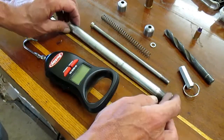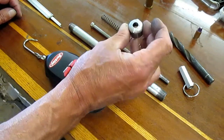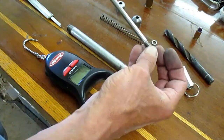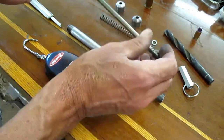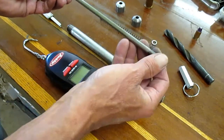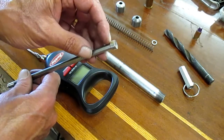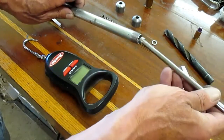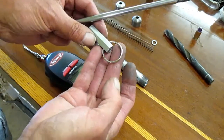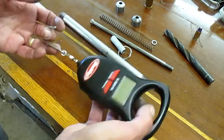It's nothing more than a piece of 3/8" steel pipe. This was just a regular 3/8" cap I turned down on the lathe. This is a reject, and this is the finished one here. I got some still pictures I'll show you too. The hard thing to find was a 5/16" 8-inch bolt that wasn't threaded all the way — I didn't want any threads in the middle to disrupt any of the readings. So this is just a piece of 5/16" rod that I threaded just far enough to put my coupler on there. I put a nut on there, brazed that on, and just turned that around on the lathe so it slides in and out of the pipe nicely with no resistance. This is a 5/16" coupler. I just drilled a hole and put a keyring holder on there, and a cheap fish scale that I picked up at Walmart — this is a 50-pounder.